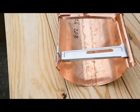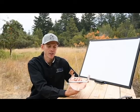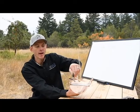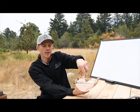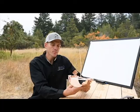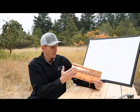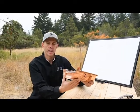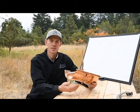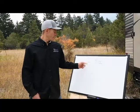Here's an example of an aluminum hidden hanger in a copper gutter. Since the half-round gutter doesn't have a back to it, you have to support the back somehow. You can use a T-wedge or a strap or bar out of the top of the hanger to mount below your eave. This gives a really clean look and keeps the half-round free of any visible obstructions, giving a nice clean smooth appearance. That's another solid way to hang the half-round gutter.